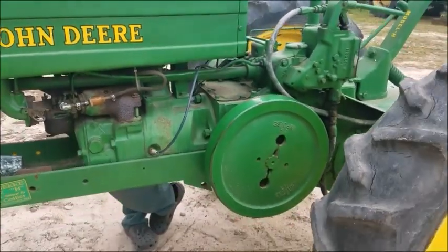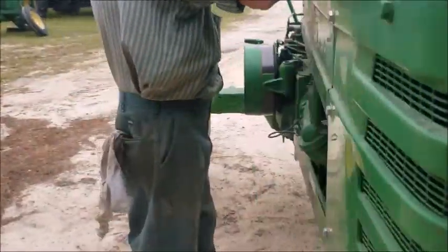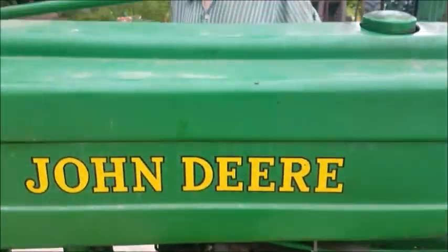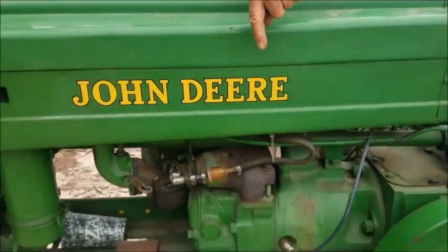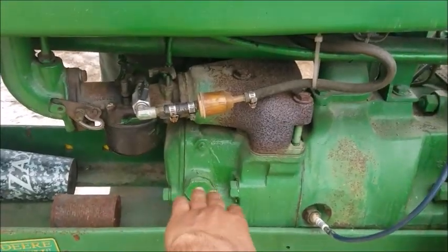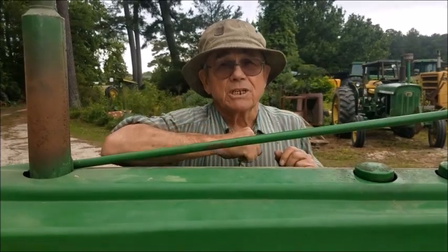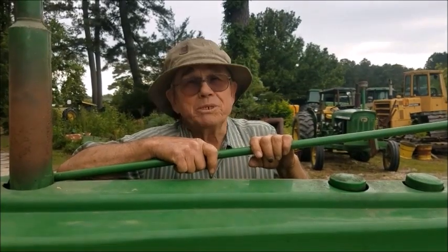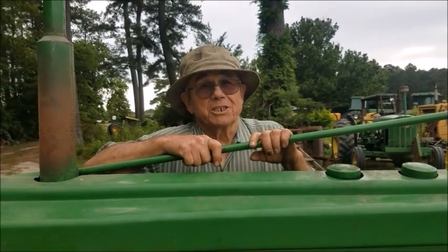And then you obviously make sure your spark plugs are plugged in. And in some of them, there are flaps that are supposed to release. You have to get a bigger tractor. The B and bigger John Deeres come with a petcock on the side, a lever. You had to flip that. It'll release the compression, because you're not man enough to turn the flywheel over with so much compression. The G's and D's, I don't do them. But I can do a B real good, but an A is kind of tough too. You really have to have some muscles to pull that thing through.